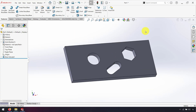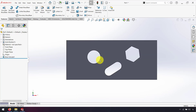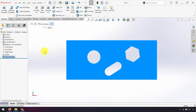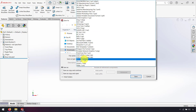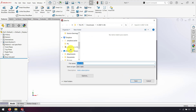If I want to use that for laser cut, I need to have DXF or DWG format. For that, I normal to the top face — we can select the top face and click 'Normal To.' After that, from File, Save As, I change the type of my save to DXF or DWG, then click Save.